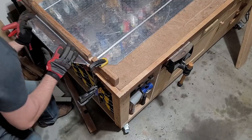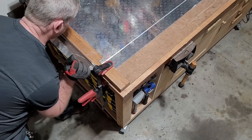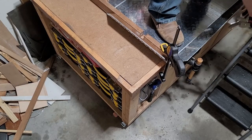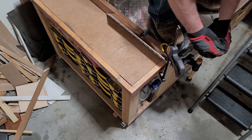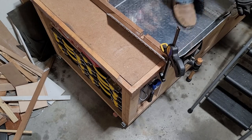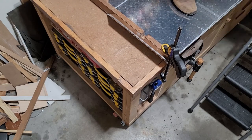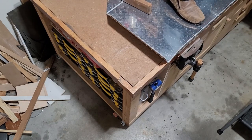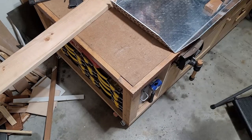Now it's time to bend the ends in on the lid. This was a little difficult — it took a little effort to get it bent. On the longer end, I ended up using a sheet metal brake. That helped out a lot. Then I started using a rubber mallet to try to get to the final bend. Standing on it again gave me the best leverage to make the bends and to keep it from shifting, especially when using the rubber mallet. Once I got everything bent to the 45-degree angle, it did end up cracking on me, so I ended up welding all the ends.